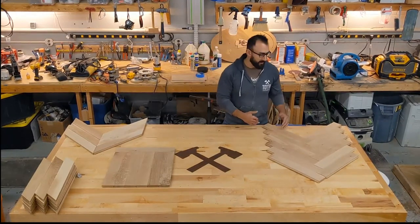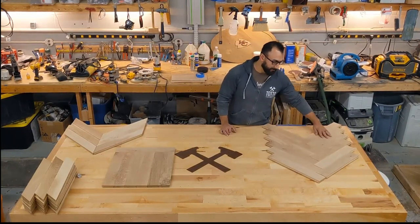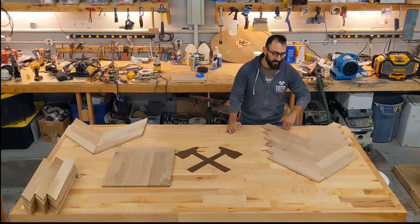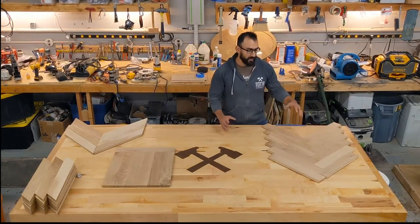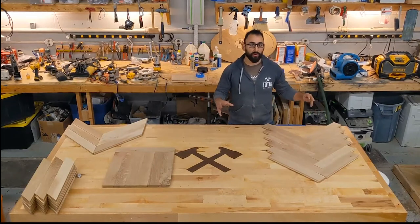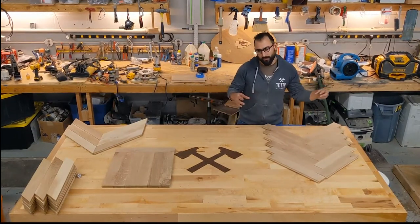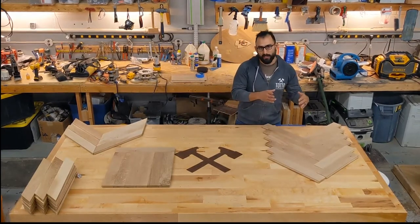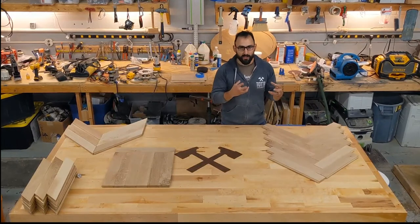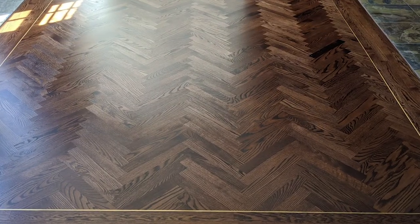It's a relatively simple pattern made up of identical pieces where every other row is laid at 90 degrees to the rows adjacent to it. When you build that pattern across the whole floor you get a strikingly beautiful effect, particularly if you have natural light hitting the floor. Because of those two grain orientations and the way light reflects back to your eye, you get almost a light and dark striping effect similar to a well-manicured lawn.